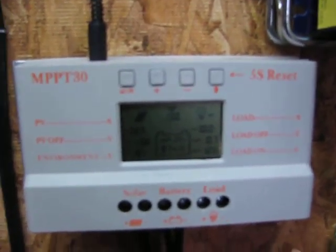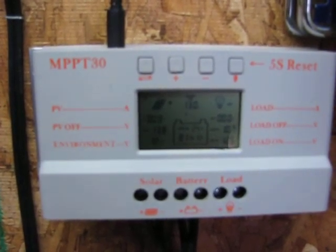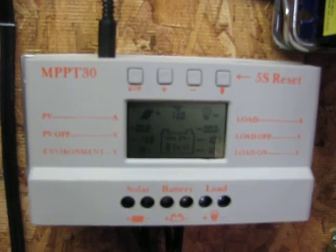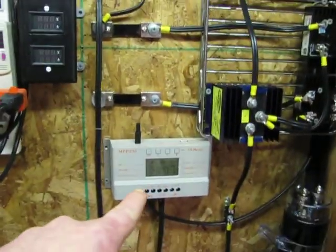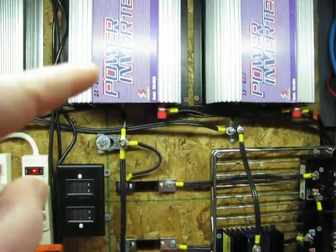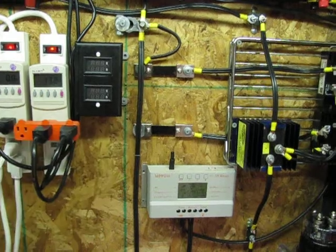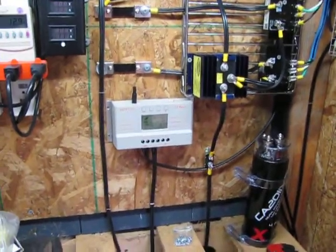I'm not going to. I'm just going to let it control the battery voltage and charge them up. When the batteries are fully charged, it'll turn off the PV — the solar panels — and I just have solar panels hooked directly to the grid ties. So when the batteries are fully charged, this thing should turn off and all the power should go to my grid ties. And then if the batteries drop a little bit, this thing will turn back on, charge them up again, so it should be able to keep my batteries fully charged. So we'll see what happens.